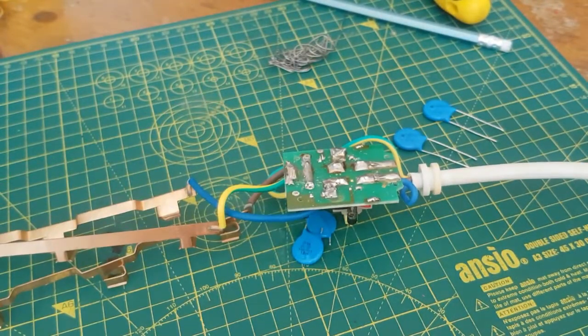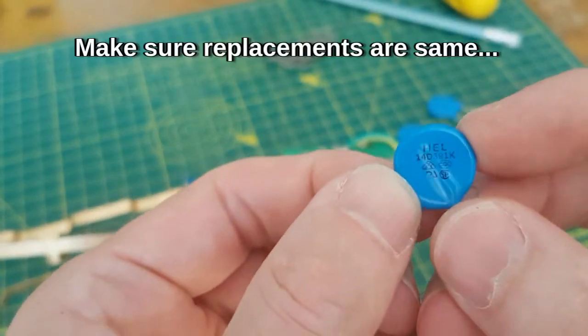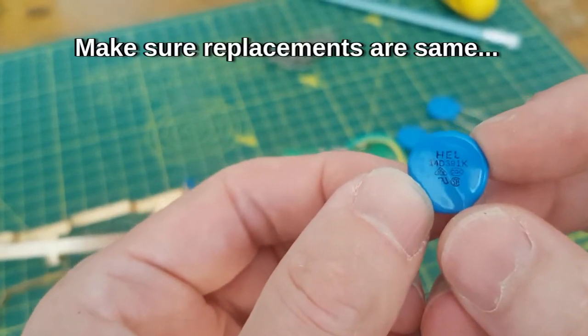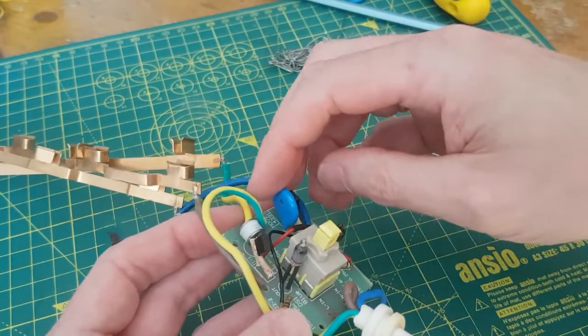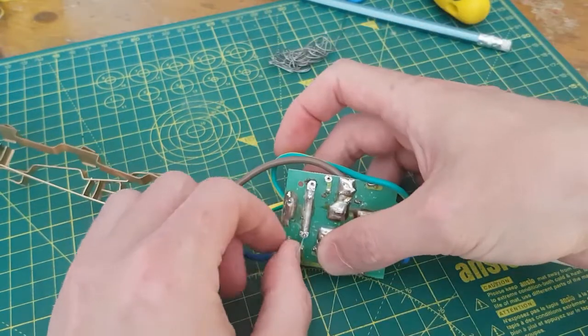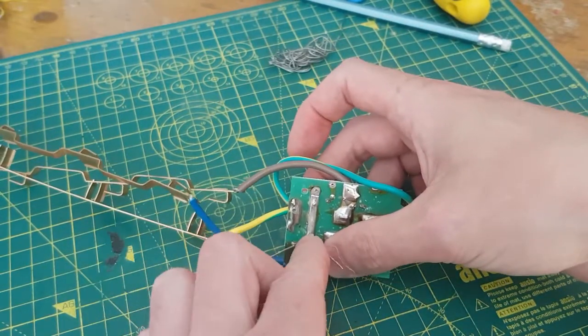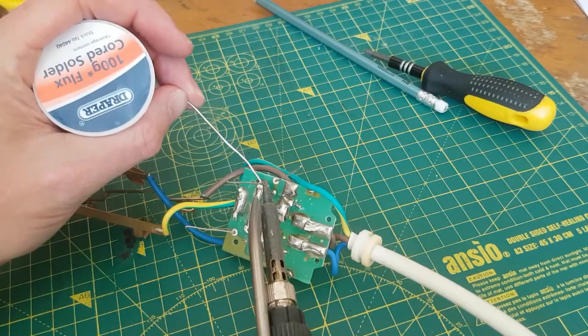That's out — so that's done. Just to make sure we're doing like-for-like, 14D391K going in where the holes are. Get it nice and flush up against the thermal fuse, then bend the legs into position. And be careful not to blow the thermal fuse while soldering.